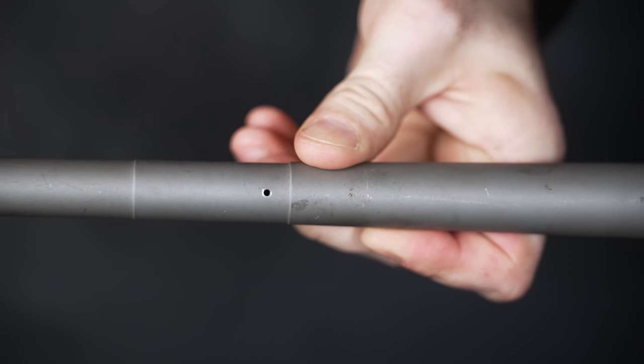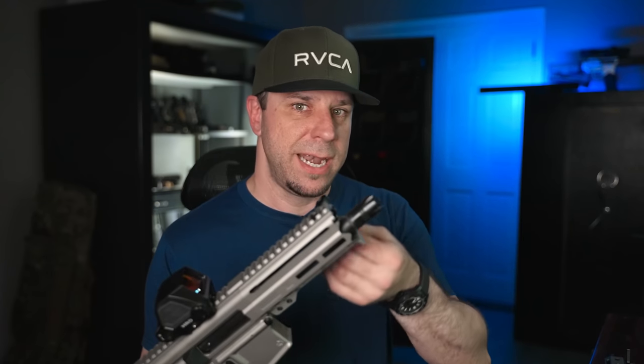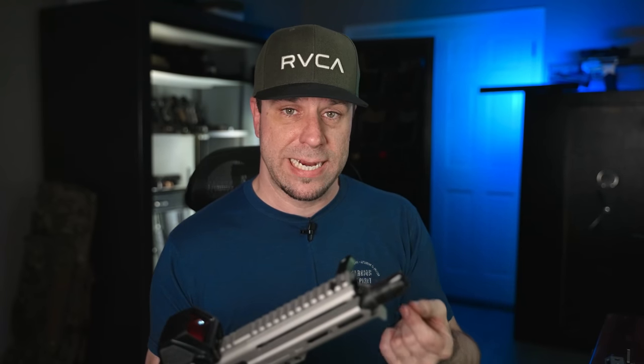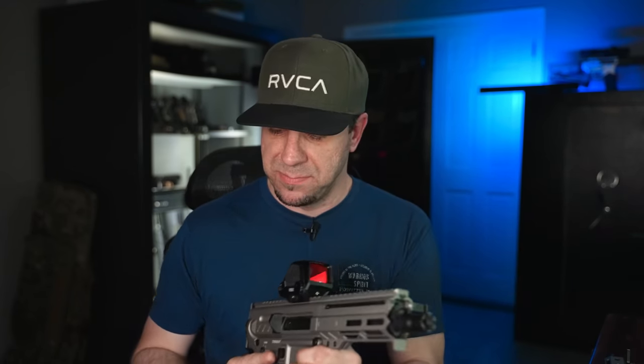So I contacted the guys at CMMG and said, hey guys, what's going on here? Can I get another screw? So I sent it in to them and they actually contacted me back and said, hey, I know you got the pre-production model. Your gas port hole was undersized. And so that's why you had to loosen it up all the way. And essentially what had happened was I loosened it so far that it backed out. And so you shouldn't have to loosen them up that much. So they replaced the barrel with the production model that has the correct sized gas port, replaced that screw, and it's been running really reliably ever since.